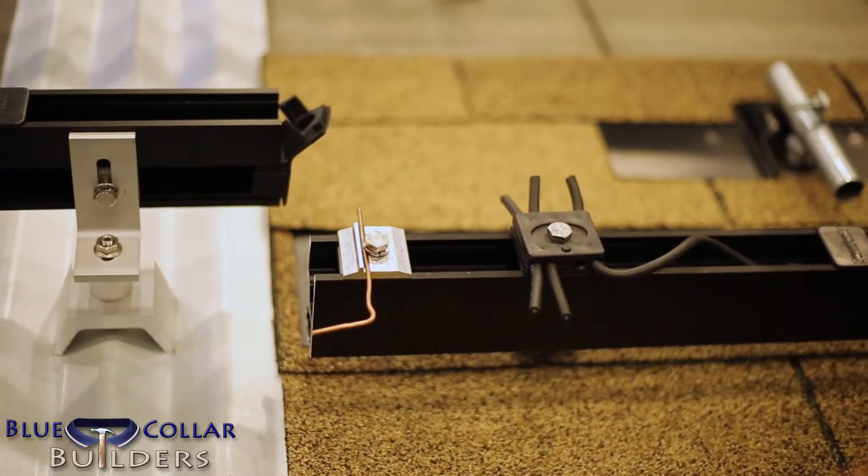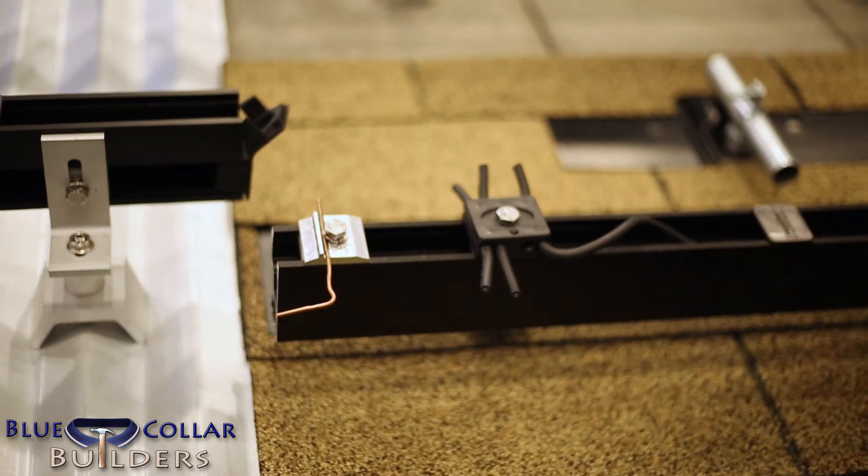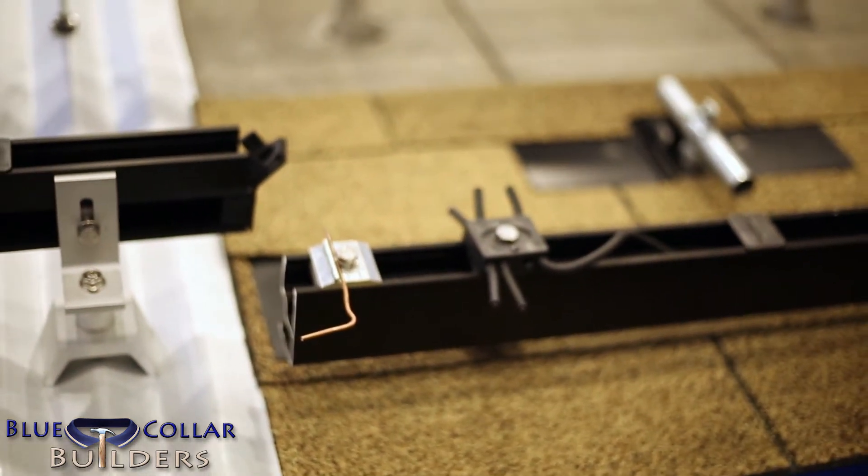Having the integrated wiring channel not only makes the job look better but it's a lot safer. We have not one but two wire channels. If installers are also installing micro-inverters, they can use the top channel for their main home runs and AC wiring, and the side channel for their trunk cables and any other wires they need to manage. Our grounding connection is unique — it's the only grounding component needed to ground the entire system. It snaps into place and can be installed multi-directional.